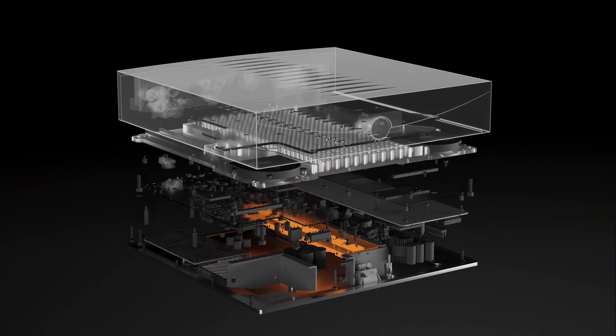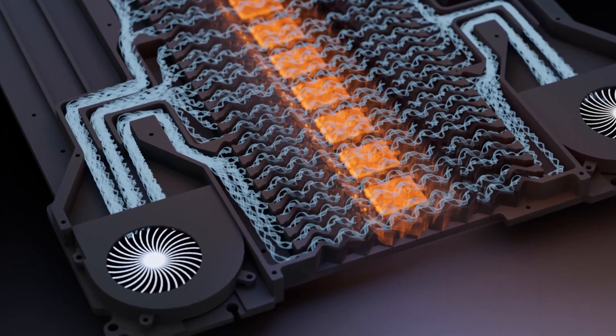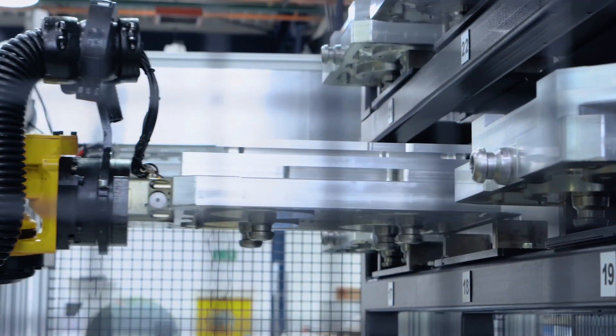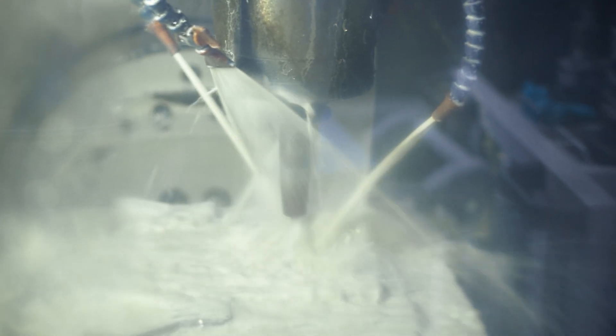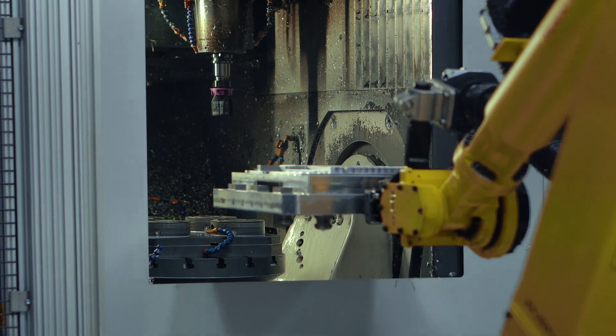When the active part of the cooling system starts, air is pressurized and equally distributed through the channels between those same fins. As the air moves along each of the channels, it pulls the heat away from the fins and exits through the top and rear of the amplifier. The cooling fins, with their zigzag shape and restricted openings, are designed to allow the air to remove the maximum amount of heat as it moves down each channel. The openings of each channel help to equalize the pressure and flow of air across the cooling plate, while the zigzag profile of the fins helps to encourage turbulence and increase the interaction between the moving air and the fins.